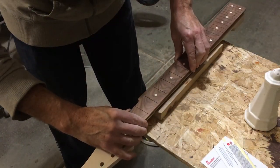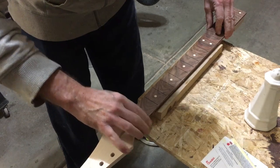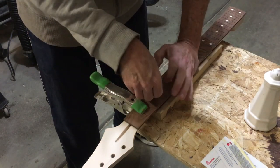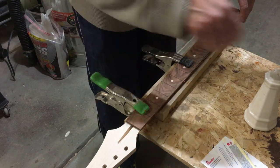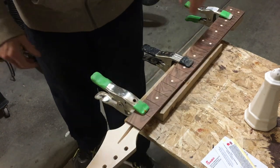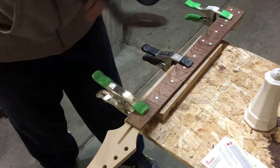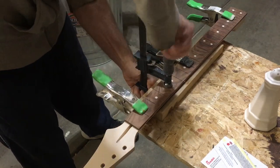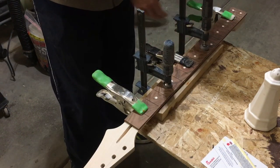As I clamp the fretboard, those grains of salt will act like cleats and keep the two pieces of wood from sliding against one another. It won't take a lot of salt — just sprinkle it in a few spots like you see here. Now I'm ready to position the fretboard on the neck. First I'll set it into place and use some light squeeze clamps to hold it while I get ready to clamp it down more firmly using ratchet clamps and C-clamps. You've got about 10 minutes of working time with Titebond wood glue, so you don't really have to rush, but you want to make sure you have all your clamps ready to go. Before you install the big clamps, you want to make sure that the back of the neck is adequately supported — if it isn't, the neck wood could crack.